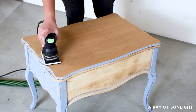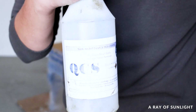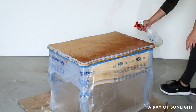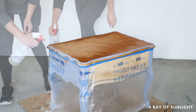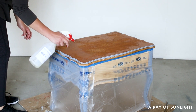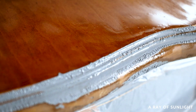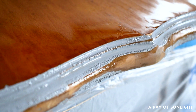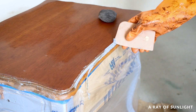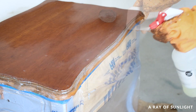And since I hadn't used this piece to test out enough stuff, I used some StripWell QCS stripper to remove the paint in the grooves on the top edge and in the few little gouges in the middle area. This stripper claims that it works on vintage finishes and I've had great success with it so far, but I wanted to see how it worked on a modern paint job. Sure enough, it worked very well. As time goes on, this stripper is becoming my favorite.